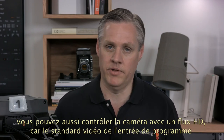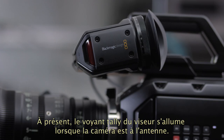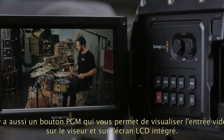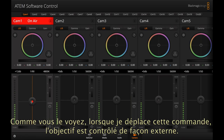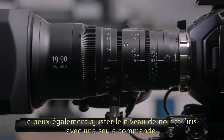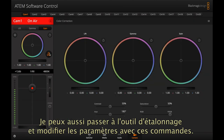When the camera is on air, the tally light will illuminate on the viewfinder. There's also a program button so you can switch to the video input source on the viewfinder and the built-in LCD at the push of a button. The camera will receive all control information on the program input and all I need to do is control the camera from the ATEM switcher software. As you can see, when I adjust the control, the lens is moving and being controlled externally. I can adjust the black level and iris with a single control, and I can also switch over to the color corrector controls.